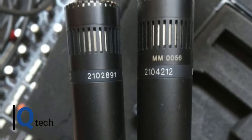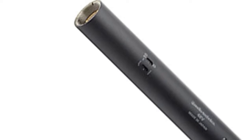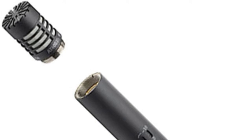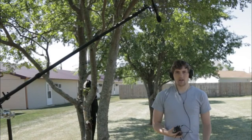A clean signal produced under high output conditions is achieved by a direct-coupled balanced output. It has a switchable high-pass filter to minimize low-frequency noise, and a minus 10dB pad will pick up the louder sources of sound. Its circuitry, without any transformers, will reduce low-frequency distortion. So many working positives about this microphone. It is small, compact, and lightweight, but it's built like a truck and is obviously built to last. Like most quality mics, it is very sensitive, but when aimed at the target source, it omits the vast majority of external sound.